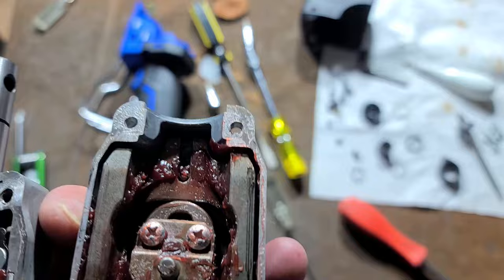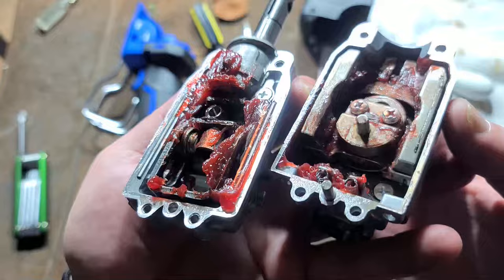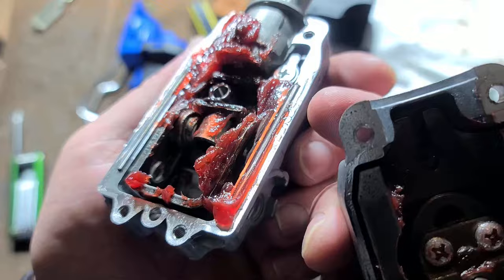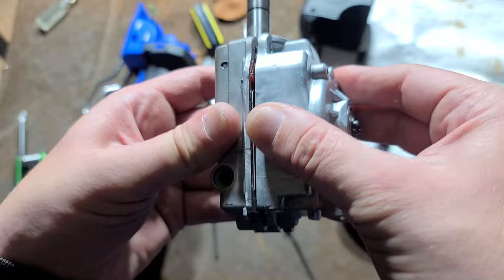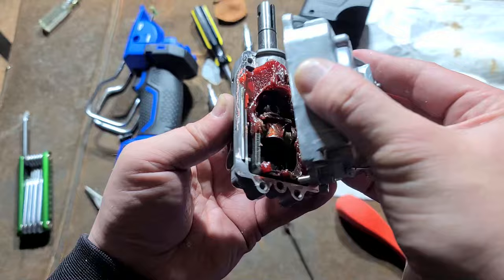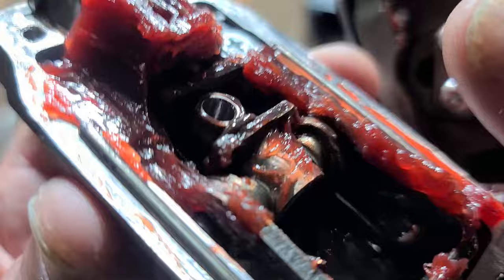It seemed lower in vibration. The gearbox comes in two halves with hardened steel rods pressed in — these act as alignment and support. You have to make sure the pin ends up in that little sleeve bearing when reassembling. The gear turns and that's the crankshaft.